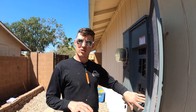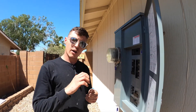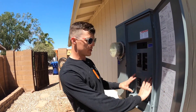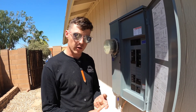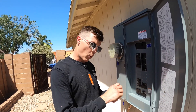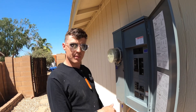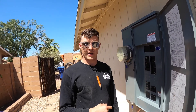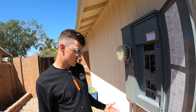And if your wires are not long enough, here's another good tip: just add a wire nut — it's okay. This is considered a junction box. If I took this off, you would see I had multiple ground and multiple neutral wires that were not long enough, so I wire-nutted them, put some tape on it, and ran it up to our neutral bar where it fit.